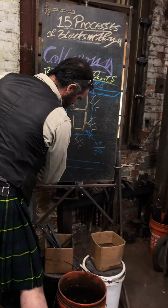A little bit of a forward lean to lock myself in the right position. Don't be in a rush. Make sure it's square. And fold. Keep your fold at the vise rather than out here, so I'm actually trying to get it to fold at that corner.